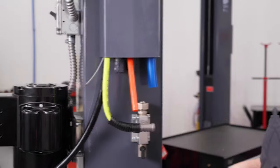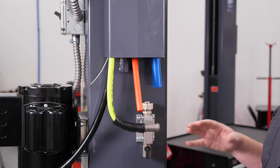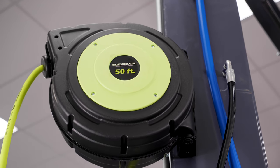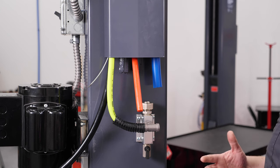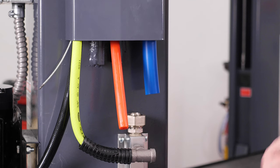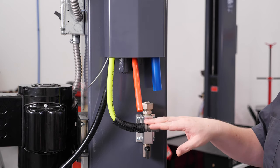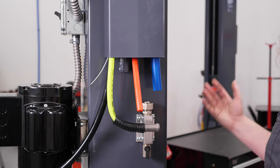Now at our final air drop, which we put on the side of our two-post lift, we also added a 50-foot retractable hose reel so we have an air hose handy at all times. We'll also add a couple of quick connects here so if we need a second air hose or need to use two air tools at the same time, that's no problem. When running long straight tubing runs, use the provided clips every five feet, because with temperature changes the tubing will expand and contract.